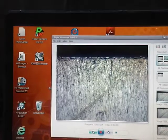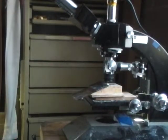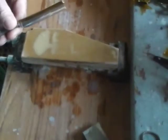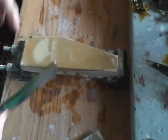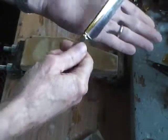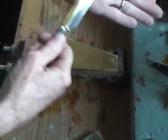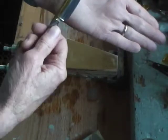And the way I do that is with some hand stropping. Hand stropping doesn't have to be dangerous. There's two basic strokes, just like in honing a razor. There's a back and forth, or there's a one direction. This is the safest for a person just starting out. Do a certain number, the full length of the blade on one side, and then you just do the other side.